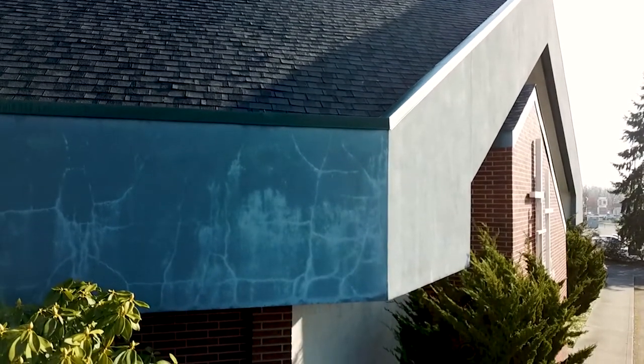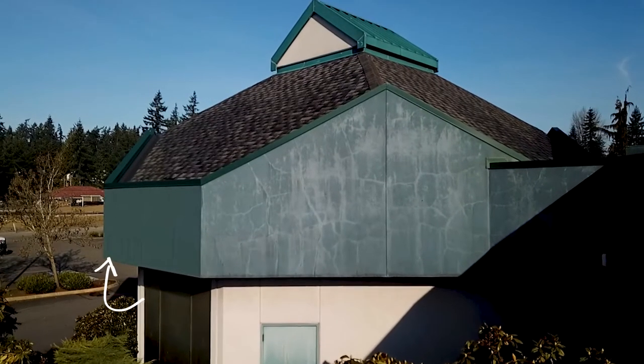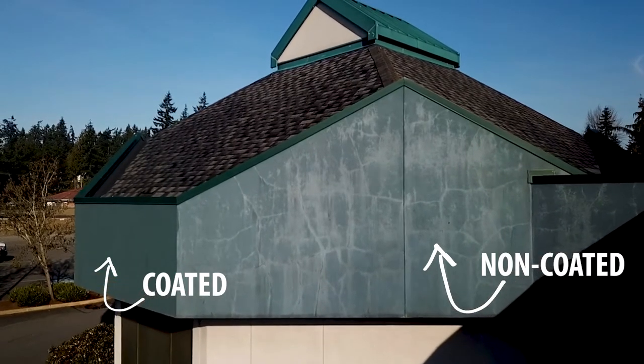There's a spectrum of stucco coatings: you can start at the low end with exterior grade latex paint and work your way up to a real silicone-based coating — expensive, but effective. The key with any stucco system is you want these coatings to breathe; if you seal it all up you'll just sweat your building to death. There are elastomerics and all sorts of options in that spectrum, ranging from $20 to $350 a gallon. It also depends on exposure — on the coast getting blasted with storms and saltwater, err on the high side. You can go low and get three to five years, or a step above that has gotten about 10 years of life.